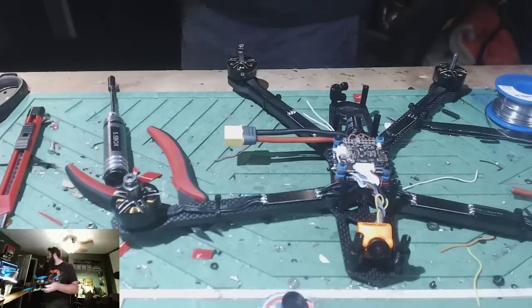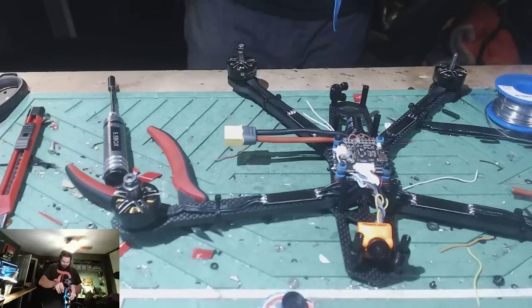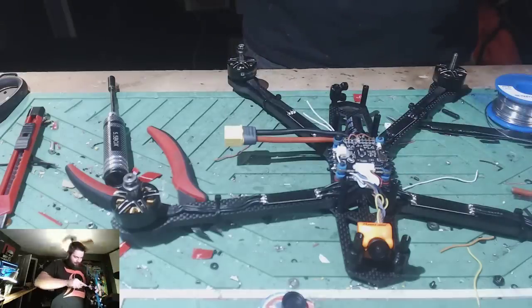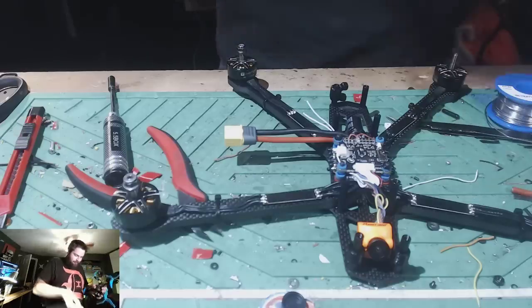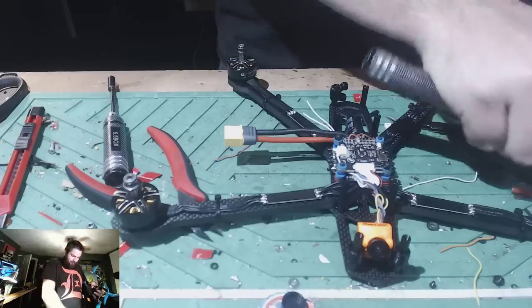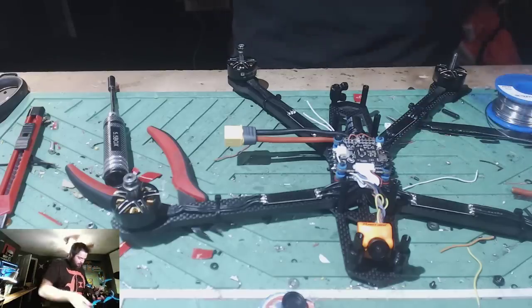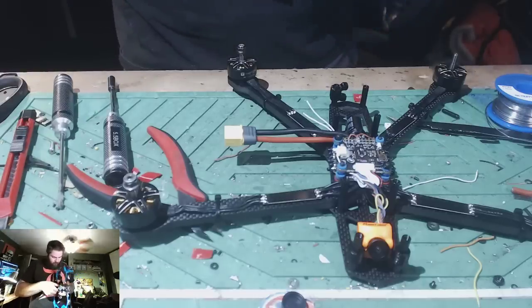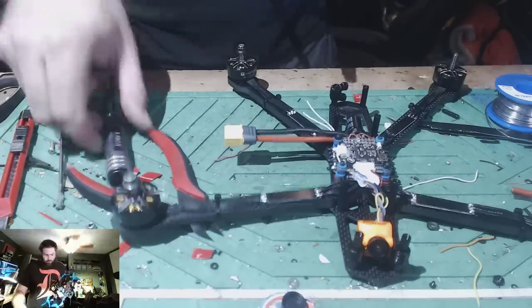Yeah. And that's a misconception that a lot of people have with long range, that you're carrying too heavy of a battery. You're not. You can throw a giant battery out there and you just fly with amps. You focus on what is the most efficient watt per kilometer, pretty much, and you cruise at whatever that amp draw is. And you can make your battery last forever.